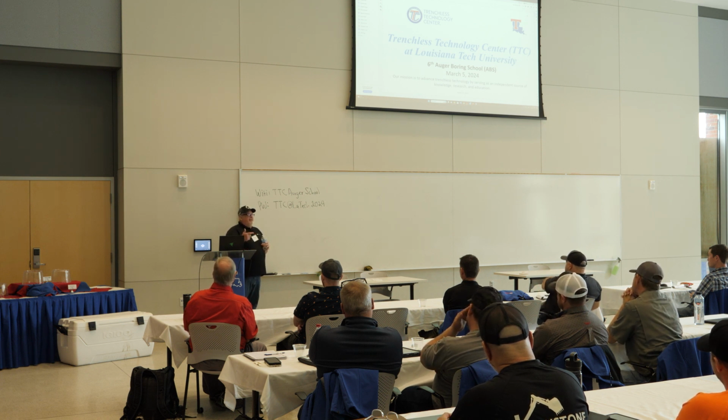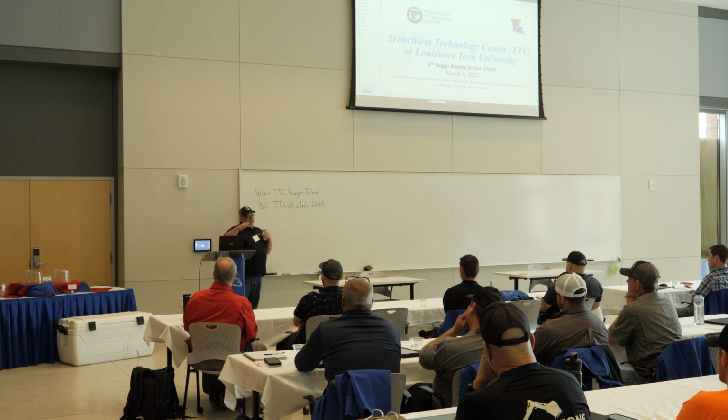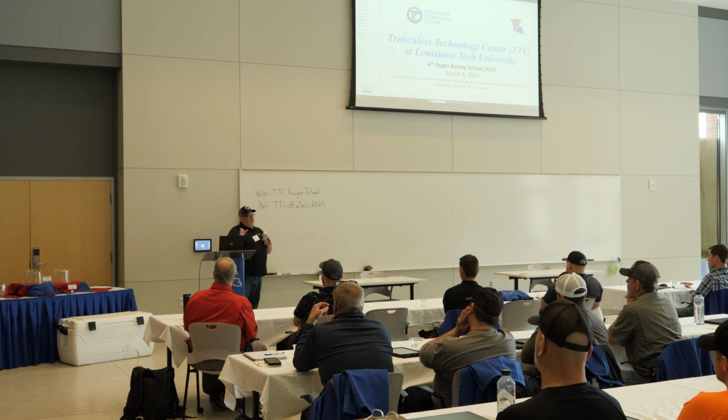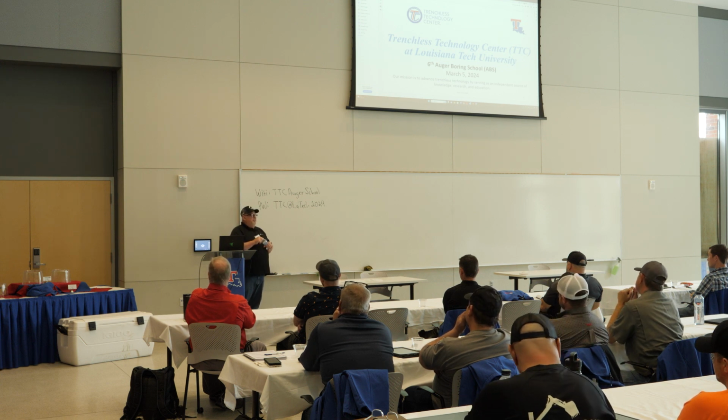Mark Bed machine back in '94 did 880 feet, but 36 inch. They were off on grade by 2/10, but they were high and still usable. 36, they had 4-inch hex and never broke the hex, but they went 17 feet to the right. So that's a gradual bend, but it's still a lot. But it tells you how much slop is in the augers and stuff. But even going around a curve like that, you're going to build up some torques, you're going to rub your augers. It's just going to wear stuff prematurely. So it's best to keep everything on the line and grade as much as possible.